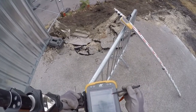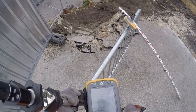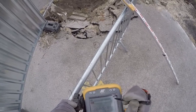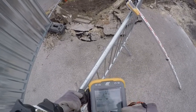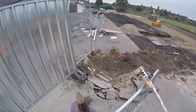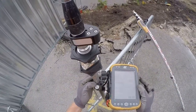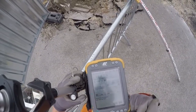What we have to do now is — typically you'd have a blank screen here and you'll click Add. The station we are on is BK4, so the point here is BK4. What you do is go in there and type in the name of your station or your control point. Then you have to enter the height of the receiver, which is the prism, so the total station can work out how high it is off the station and how high the actual machine is itself. So that's at 1.5 there and we're at 1.5 in there as well.